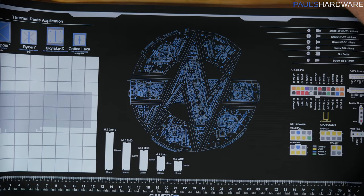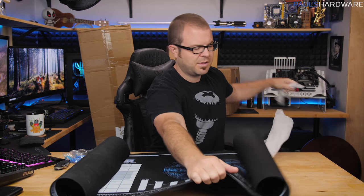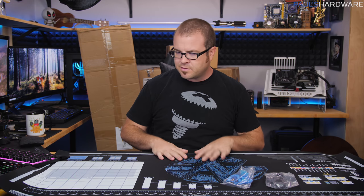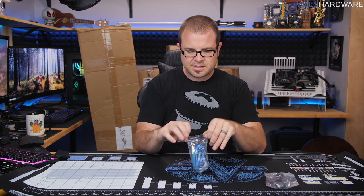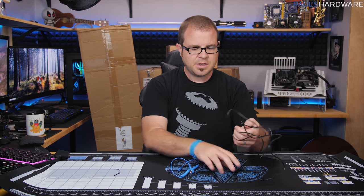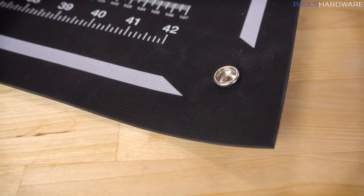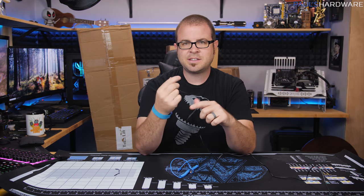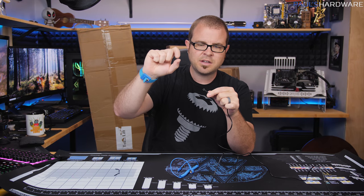Let's unravel the thing — wow, that is large. That will fit across an entire desk; it's actually too big for my small desk right here, so it's going to be more suited for the work table. The mod mat serves several functions: first it's rubberized, providing a protective surface to work on. It's also an electrostatic discharge tool — you can ground the mat itself. Two cables are included; one has a snap on the bottom so you can snap it directly to the corner of the mod mat, and then route the cable over and connect it to something grounded.